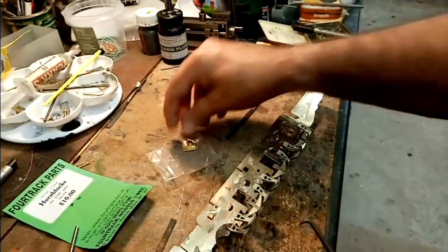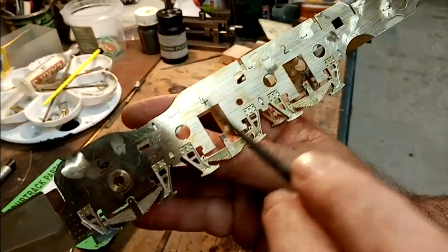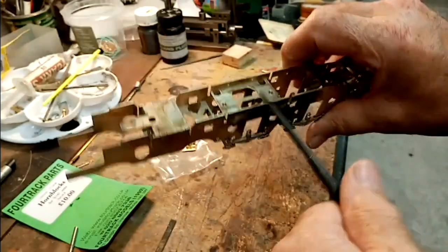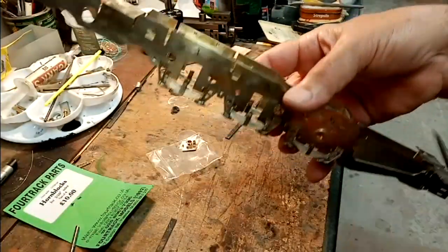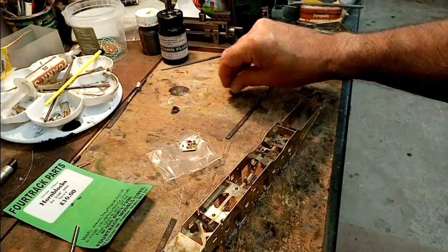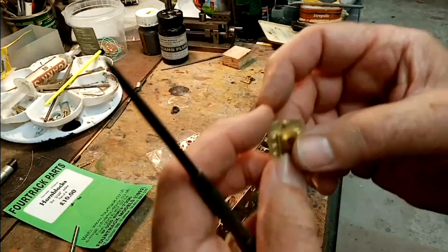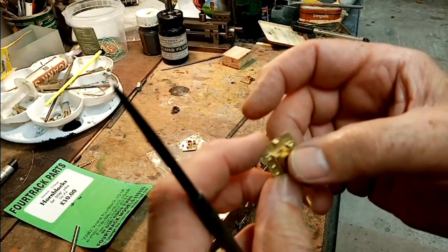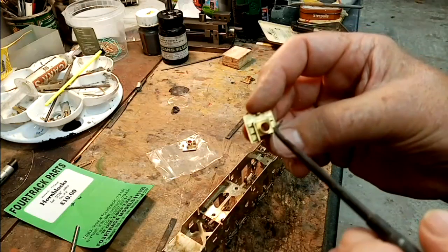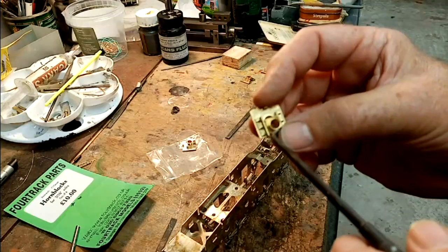This is number four. Again, I've just marked on the position of the six axles. So it's one, two, three, four, and then five and six are the driving axles. Right, so we now have to set them. As I said earlier on, I like to have about a millimetre of vertical float above the centre line for the axle boxes to float up as well as down.